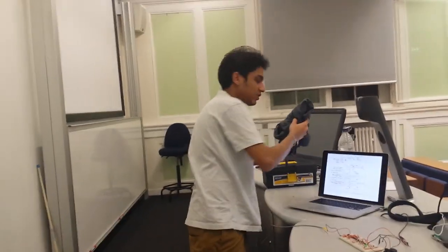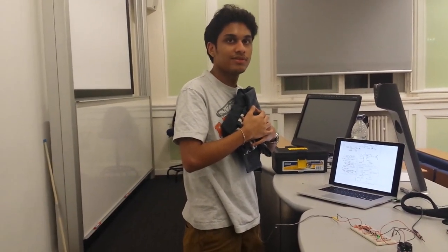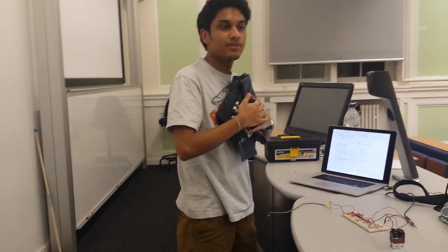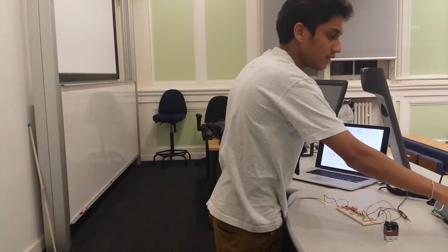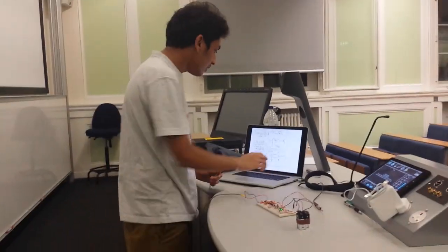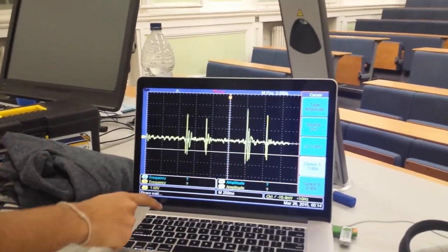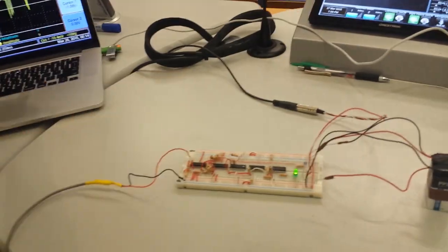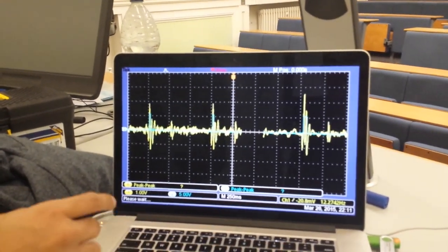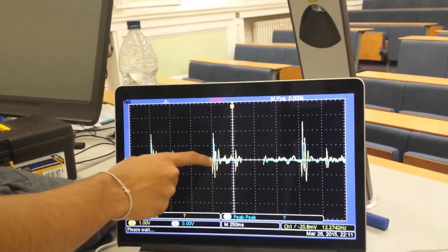I'm going to use this just to insulate myself and put some noise around. I'm recording this so I'm nervous, which is why it has been faster than expected. When it's around one volt it's definitely a heart sound — so that's our threshold. We have a Schmitt trigger which digitalizes the circuit, and then an inverting summing amplifier to shrink that signal down and shift it up, converting it to go from 0 to 5 volts.